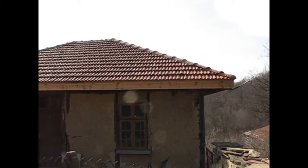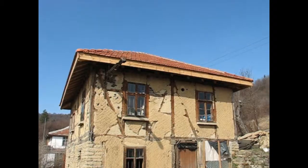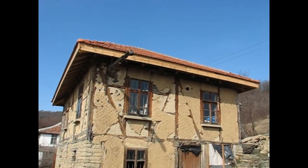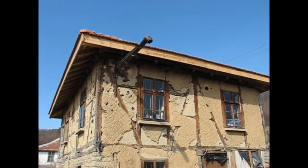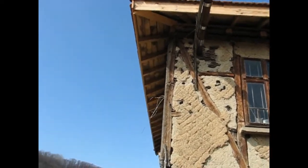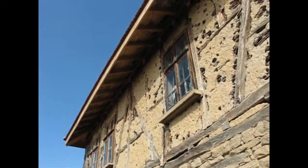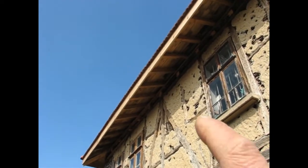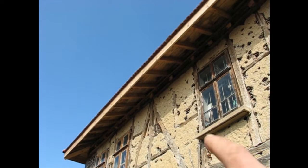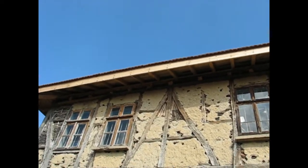We'll pay good attention to the fascia boards. We want to see that the fascia boards are straight, level, not rotten, not sagging. I would walk around the whole roof from the bottom first. On this particular roof I see that there's no soffit — that's going to be installed probably this spring. But I would take a good look at the soffit if there was one. I can also see there is a hydro insulation over here, a water barrier, which means there are boards on top of the rafters. That means there's less chance of breaking a batten and falling through.